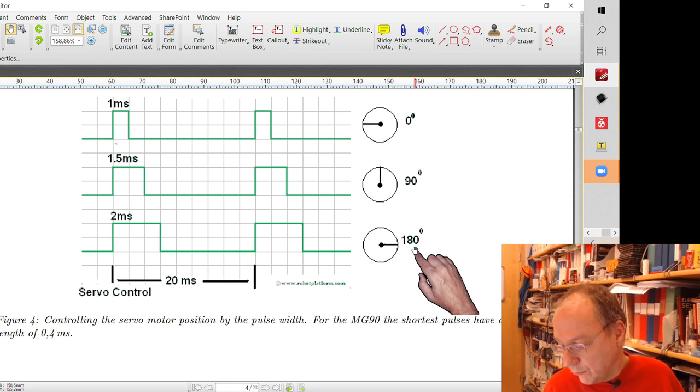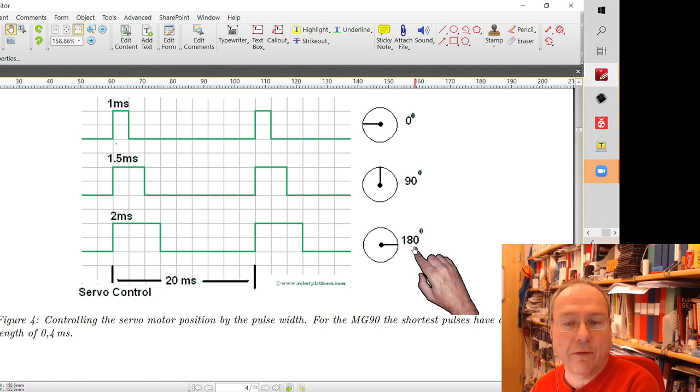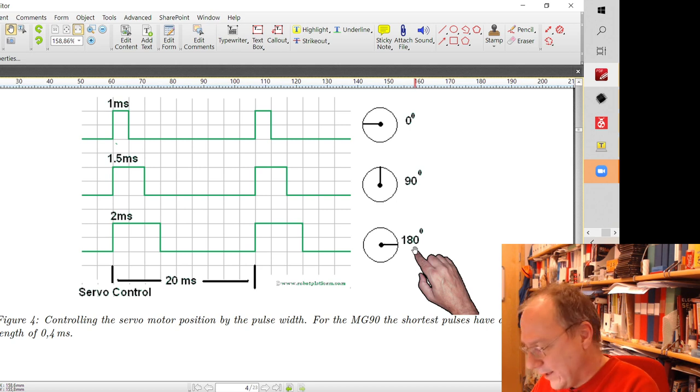So these are not continuous rotation motors. They only can turn something like 180 degrees. Some of them can rotate 270 degrees. When the motor is not connected to the supply voltage, you actually should be able to turn the axis, and you hear the gearbox squeak inside. And so this is what the motor on the inside does as well. It just turns from the other side of the gearbox. And you see, essentially, this has slightly more than 180 degrees, but we will see, we cannot reach the extreme angle on this side for some reason. But this is how it works.